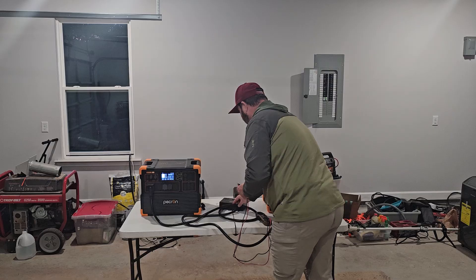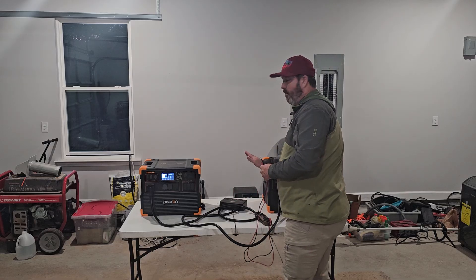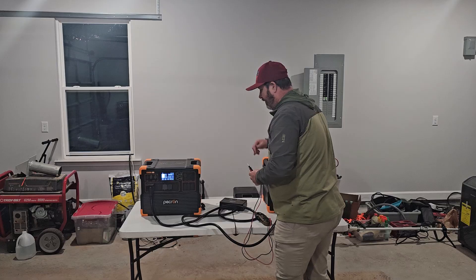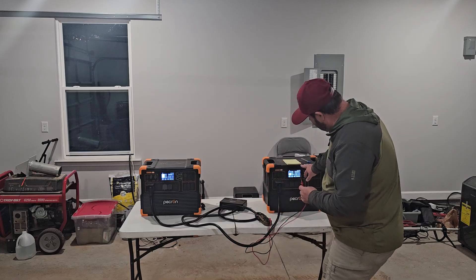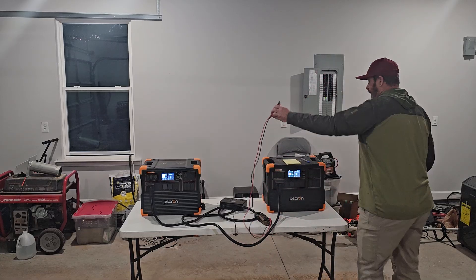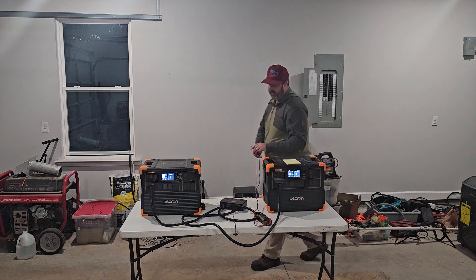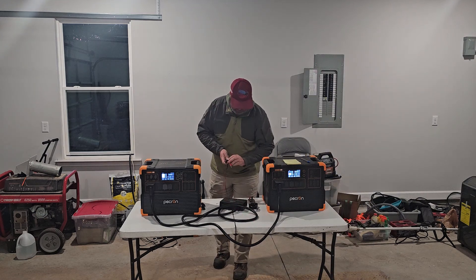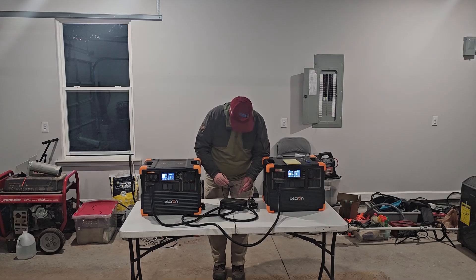You may have just heard this started beeping. It wasn't beeping when we turned on, and I had a green light. In spite of not having the data cable connected, there are still no error messages on either power station. I'm going to come around on the back side here so I'm not turning my back to the camera, and I'm going to test the line voltages.